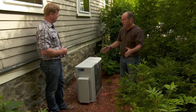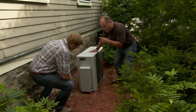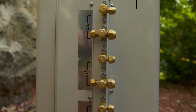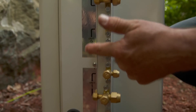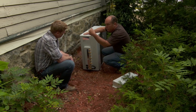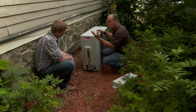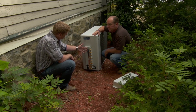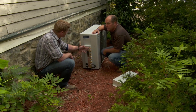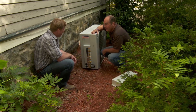But this one is so smart — the compressor can vary the amount of cooling power and split it to go into one, two, or three air handlers. A pair of refrigerant line sets goes from the condenser into each unit: it cools there, comes back, dumps heat outside, leaving cool air inside the building. This thing can send coolant equally to all three zones, or shut down two and send it all to one. Very smart — and small.